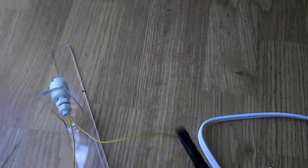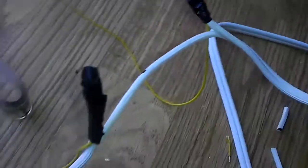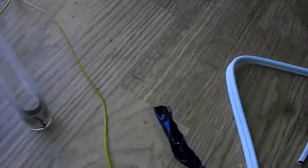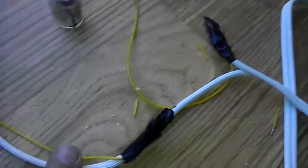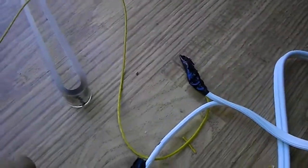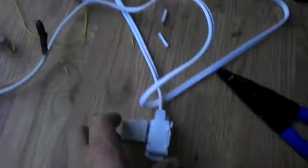Real quick — what I did. There's the switch, the two wires coming off. I used a razor blade to splice down the middle of the wire real careful. As you can see, there's my mark, and there are no nicks or anything on the other wire. Then cut one wire, which essentially breaks the circuit until the float switch completes it. Then twist them together, electrical tape real good — because remember, you are dealing with electricity. Now I'm going to wrap everything with electrical tape and make it look a little neat. There's the electrical cord and there's my splice.